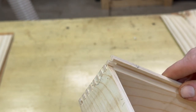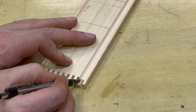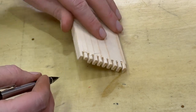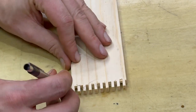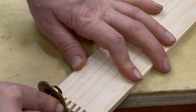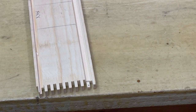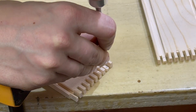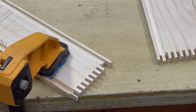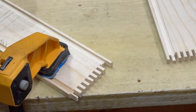To cut the middle tab, normally I'd use a band saw but I said I wasn't going to use that, so I'm going to go ahead with a chisel. I'm going to score it from this side as well so we minimize tear-out, and then go from the other side because if we were to chisel from this side it would almost certainly cause tear-out. Score along that line, flip it over, and with one blow of a quarter-inch chisel — boom, it pops right out. You can go back and clean that up a little bit if needed.